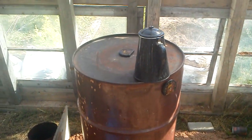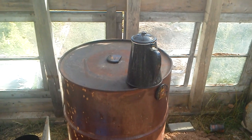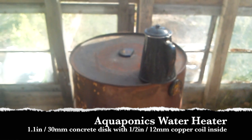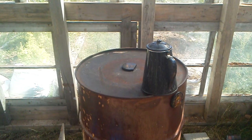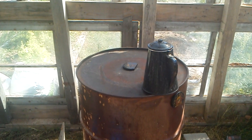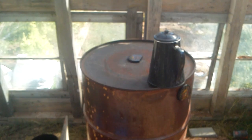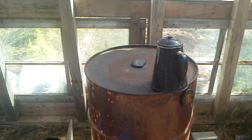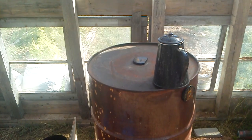On top of the barrel, I'm going to cast a piece of concrete that's just the inside diameter measurement of the barrel head. It's going to have a copper coil in it, with quick releases on the outside so you can just snap those on. The idea is to push water through that. The concrete will heat up off the contact of the barrel head, which will provide some thermal buffering from the copper pipe, so it'll be fairly hard to melt the copper pipe.